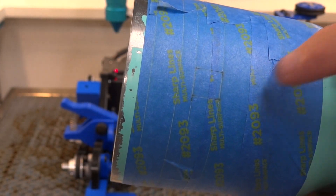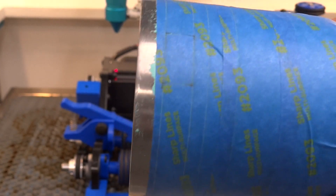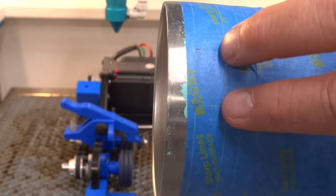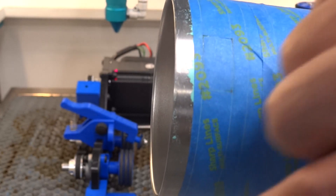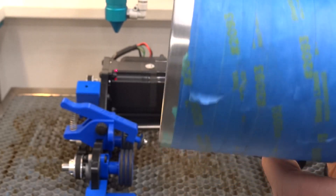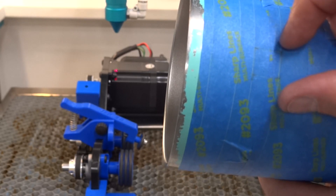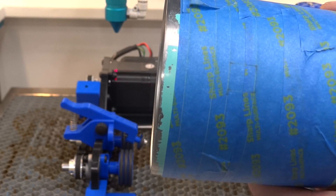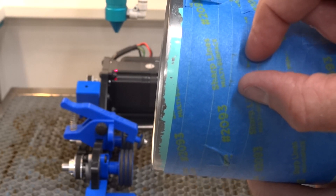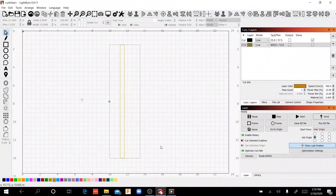We've made a little headway. These two lines are about a half an inch away now compared to our first test, which was probably almost an inch of overlap. So that rectangle had overlapped by an inch — if you did a design on this cup, the spacing would be all messed up. Here we've really reduced that amount, but we've still got more to go. We've got to lower our steps per rotation to get these two ends of the rectangles to touch. But we're making headway and making the right decisions.